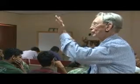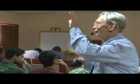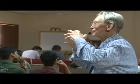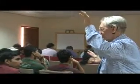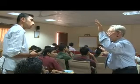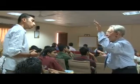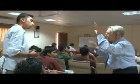Suppose it's just big motors, and you open the wrong big motors, and you know this is a bad situation. The motors have some energy because the flux is still decaying. If you suddenly close it, maybe you close it out of phase, and you're going to have some terrible currents. So maybe you need to wait until the flux decays. Picking that as an example, it's a hard question, and my inclination is to close it right away, and that is not always wise. I think the prudent thing is to say, well, I opened the wrong switch, and I'll wait until all the energy decays and things are stable, and then I'll bring the system up again.